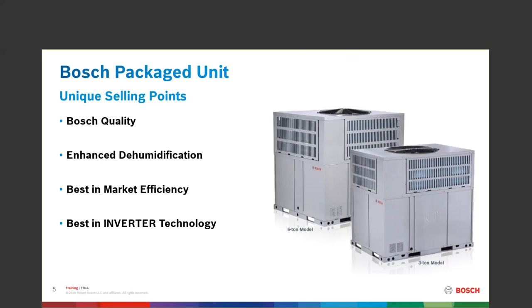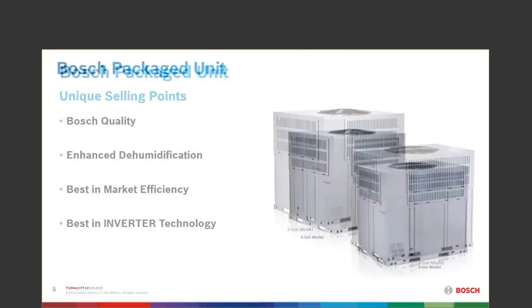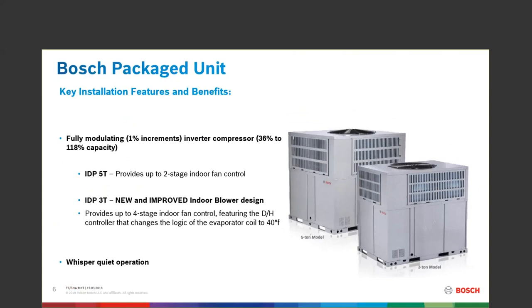When we're looking at the compressor and say it is a variated compressor, we're looking at a single-phase machine that takes L1 and L2 voltage, runs it through the board — what we call the magic — going to that compressor. That compressor will variate its capacity, ramping up and down from a 36% ratio all the way up to 118% ratio. It's a capacity-driven inverter machine.